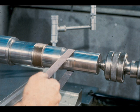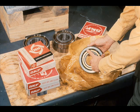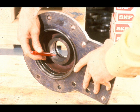When you have completed the first shaft, repeat the procedure for the other one. Most plants recommend that new bearings be installed regardless of the condition of the old bearings which were removed from the gearbox. Consult your supervisor to find out what the policy is at your plant. Don't forget to inspect the oil seals, regardless of the type.